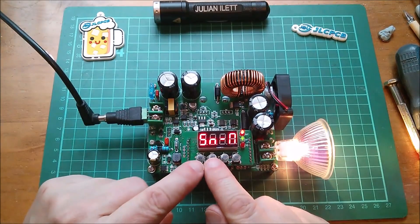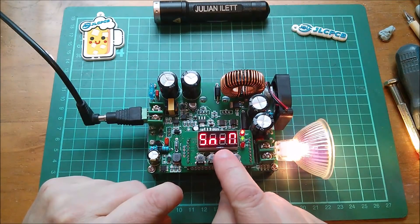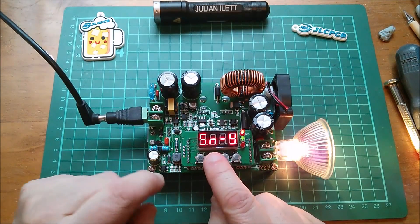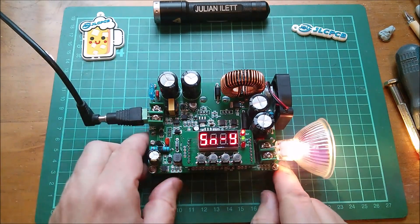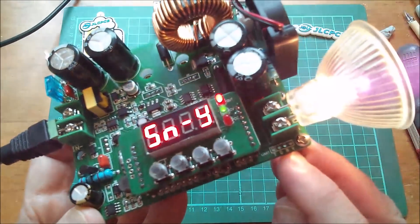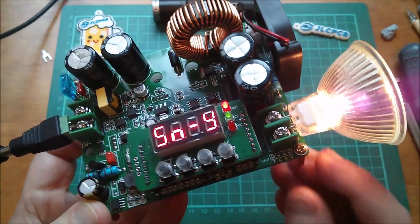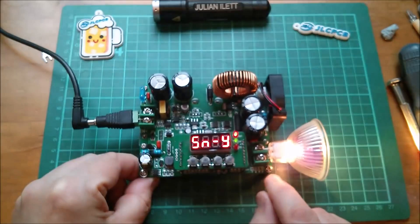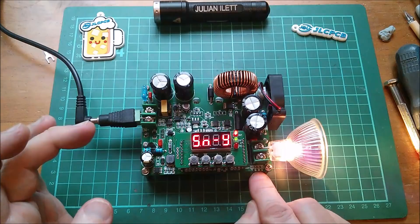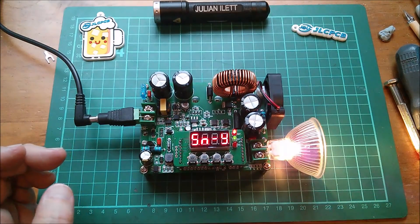In P4 I found SN with options N or Y — that might be for the serial connections. There are serial pins here: transmit, ground, receive, and VCC. That might be for use in conjunction with that monitoring software — a simple serial data interface. The other settings all look like calibration of some sort.